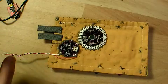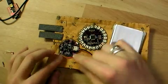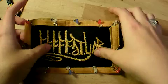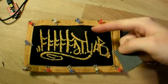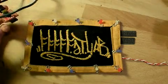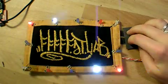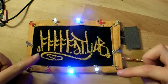So now I can power up my circuit. I'm going to plug in my lithium battery, turn on the LilyPad power supply — the little red light comes on. Now I'm ready to use my conductive Velcro to bridge the power switch here and turn on the LilyPad. I already programmed it using the LilyPad programmer hooked up to Arduino on my computer. And there we go — a nice slideshow. It's alternating, sliding every other set of LEDs around the circle.